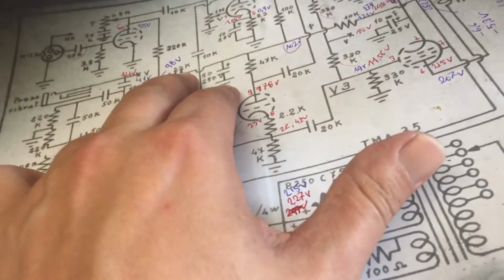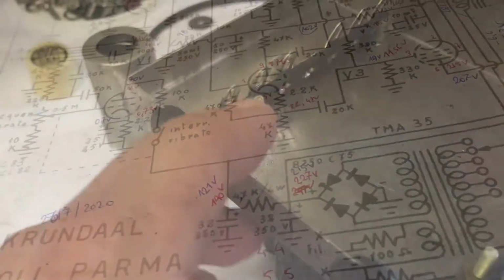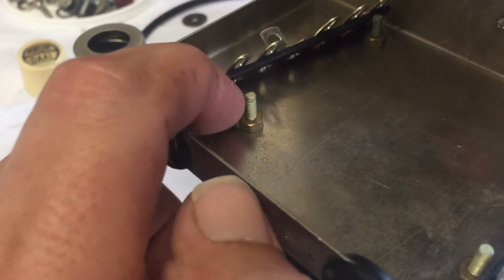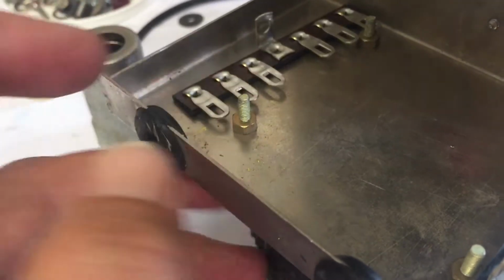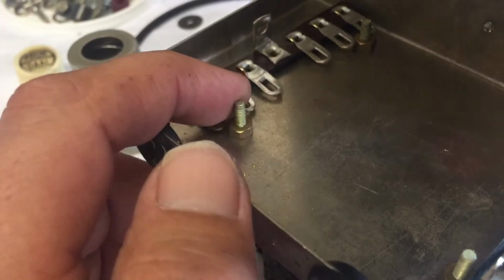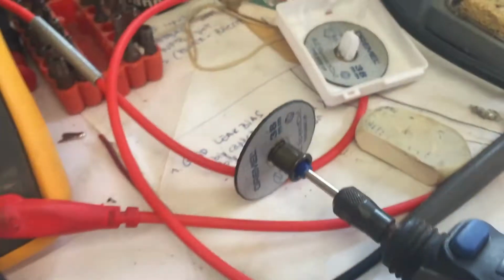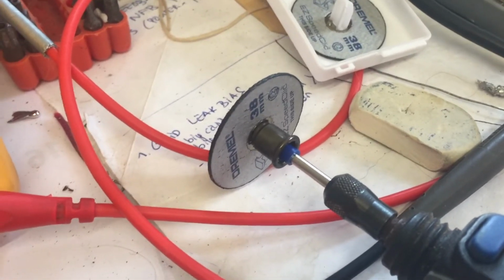now in this position. But in order to avoid things from shorting out, especially here in the power section, I will have to remove the protruding ends of these screws that hold in the power transformer. Getting out the Dremel tool.